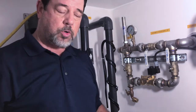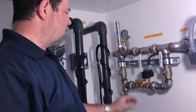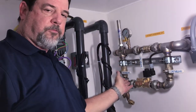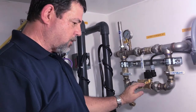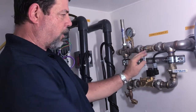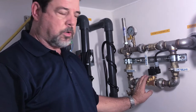The first thing you do is go to the control panel and turn off all control, because we don't want power going to the solenoid when we're trying to work on it. Second, close these two valves to keep the water from flowing in from the city or having it come back from the pool to flood your vault. Close this valve so we have no water flowing anywhere, and then we can work on the water solenoid.